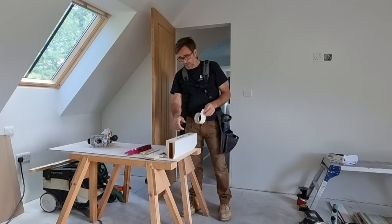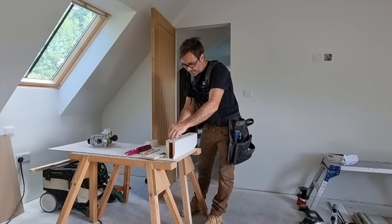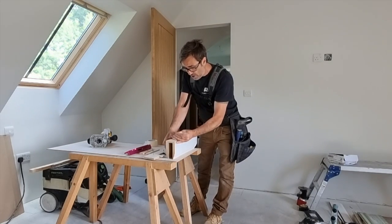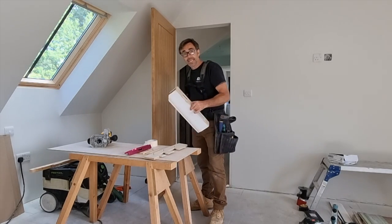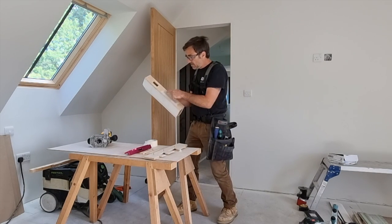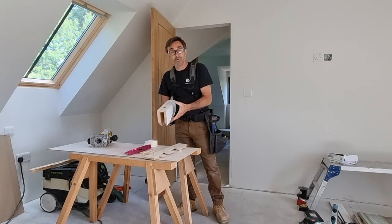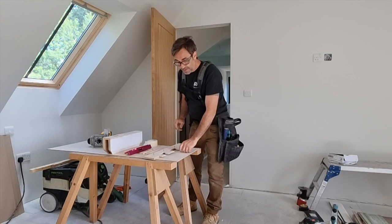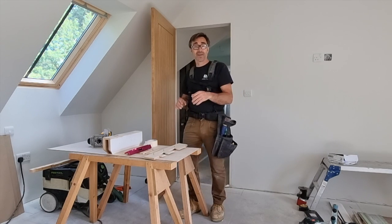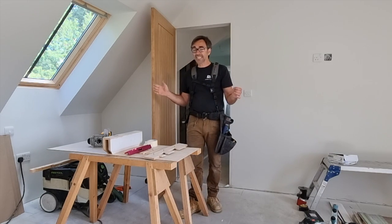It's very easy as human beings to make a mistake. For example, if I'm only doing latches at the moment, I take some masking tape and tape it across the lock portion so I know for a fact it's not the lock I'm routing. The last thing I want to do is put it on a door, get disrupted, go away, come back, and accidentally route out for the lock in the wrong position. If you do make that error you'll have to splice it in and polish it back — that will take as long as hanging three doors.